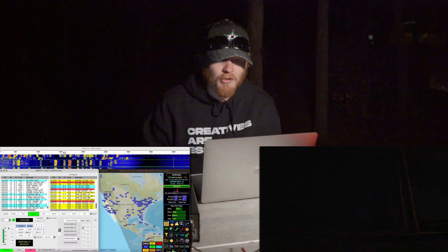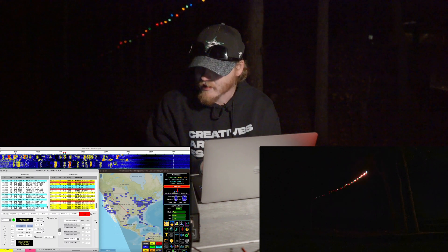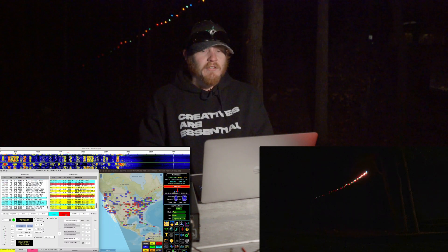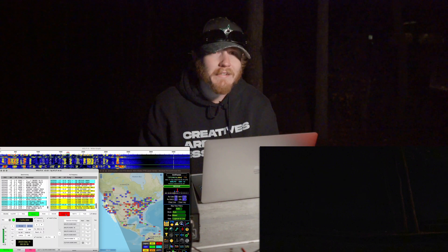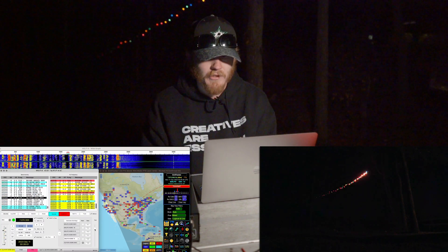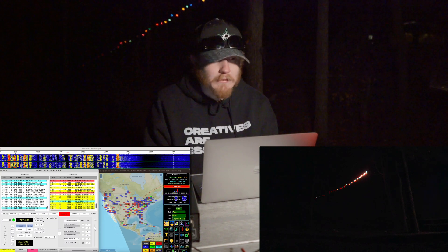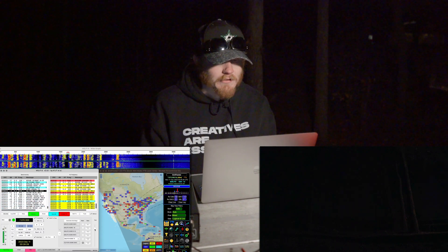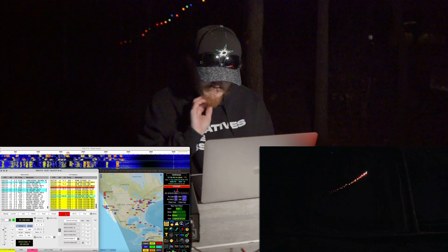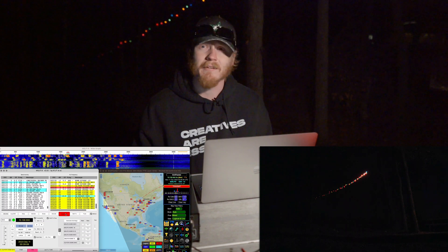I'm switching to 40. This is a 20-meter dipole, but my tuner last night was tuning it. Let's see if it tunes up — there we go, tuned right up. Only three watts reflected, that's not horrible. I'm calling CQ because I don't want to waste time. I'm also hoping my computer isn't going to die before I get 10 contacts — this cold is definitely having an effect on it. I've called CQ three times and nobody's coming back. I'm putting out 95 watts and my SWR is only 1.4. 40 is not working, so let's try 30.